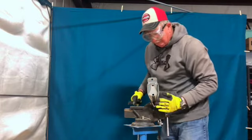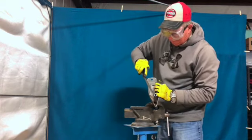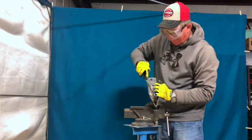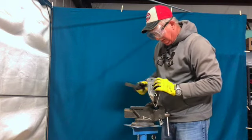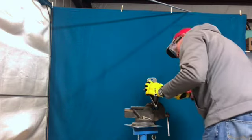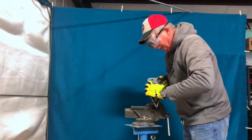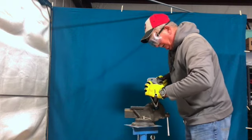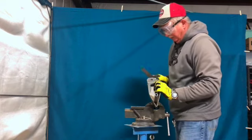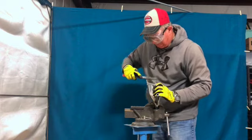And go ahead and feel around the edges with your hand. Hit those rough spots. Where you drill that hole, there's probably going to be a burr there. Get rid of that. Where you round those edges, there's always going to be a little bit of sharpness there.